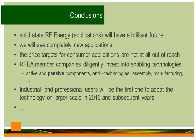So that's another area that one needs to take into account if you're trying to have the most stable impedance line: environmental effects. And then there's also the area of humidity. These are going to be found in the home, so not so much, but if you are cooking something with high humid content and some of that humidity can leak into the area of the amplifier, then that might be of concern. But typically, temperature is the part that you would need to be mainly worried about, and the stability of dielectric constant.